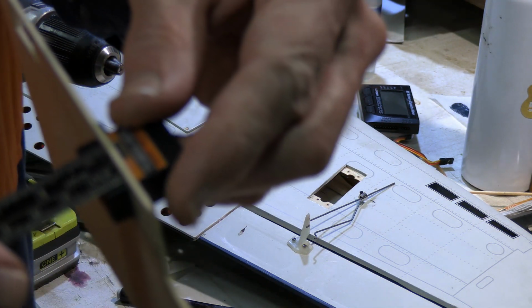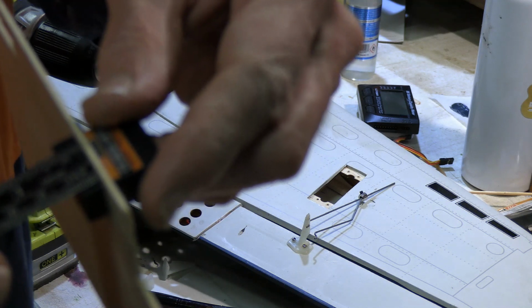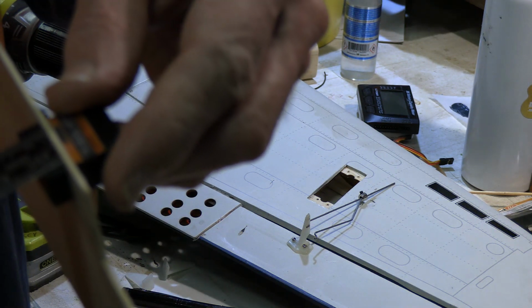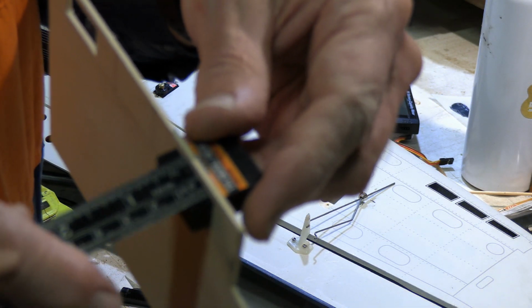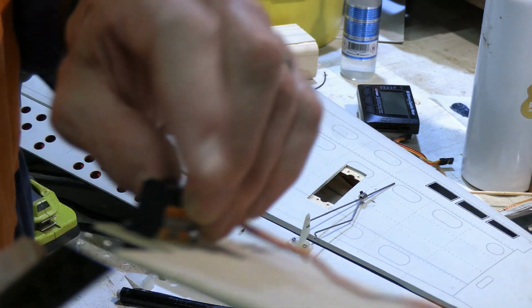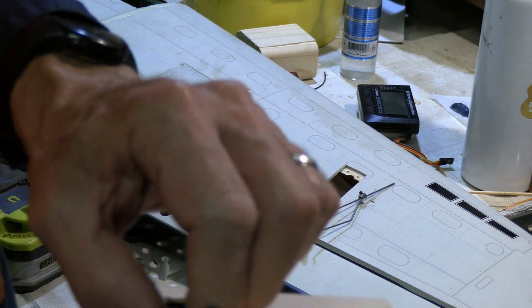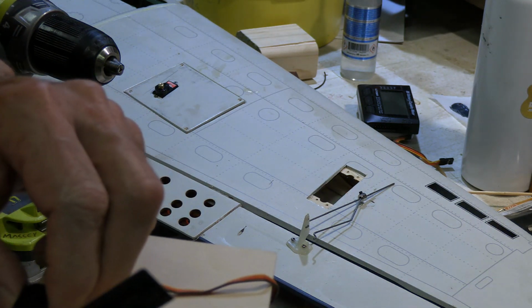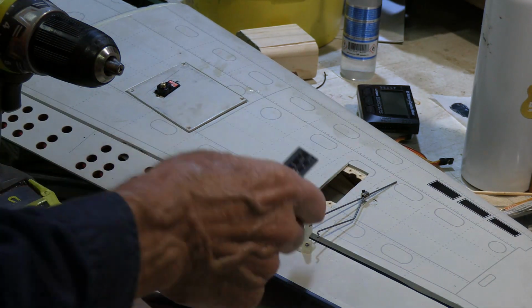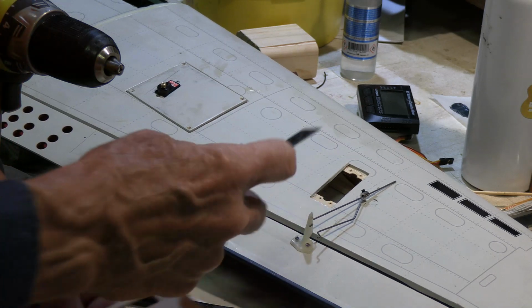And it looks like it's sticking out about 8 millimeters, 7.5 millimeters. Let's call it 7.5 millimeters that it's coming out there. So a 7.5 millimeter spacer is what we'll need. We need to realize that on these edges, it's not sitting on anything. So it's just on the end where it's got to fit over top of that. So we've got these bits on the end that come out about 9 millimeters.